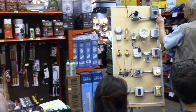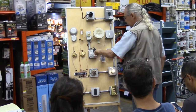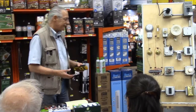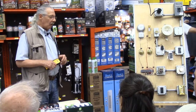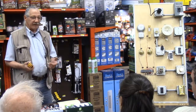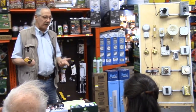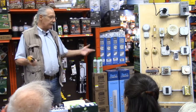We should be able to say that both of these are live. Now let's say we want to track a circuit we're going to work on. We don't know what breaker is what — I would say probably 98% of the places I go to do electrical work, nothing is properly labeled. Maybe two out of a hundred. Because even if it was properly labeled to begin with, over 20 or 30 years people have done work, wires get shifted around, circuits get added.